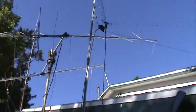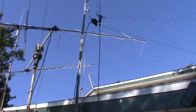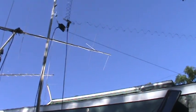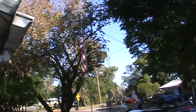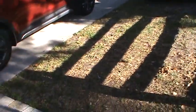I've showed you other antennas. Right up there — that black box — that's also from MFJ. That's actually a transmitting antenna. It's an end-fed antenna. It just has the one leg that goes out to my front yard, and it has that matching transformer in that box.